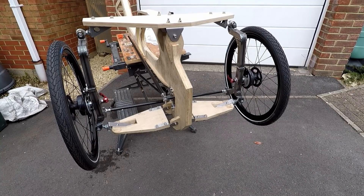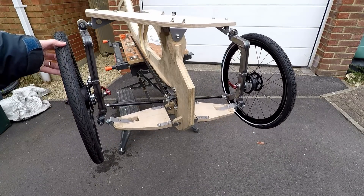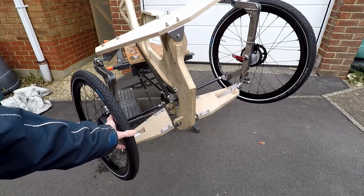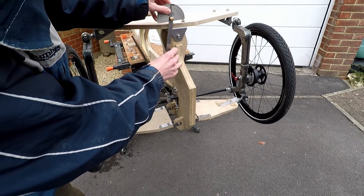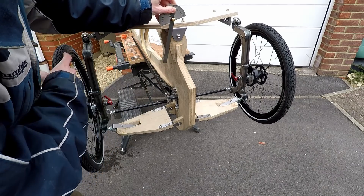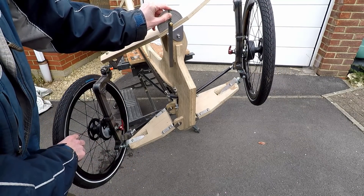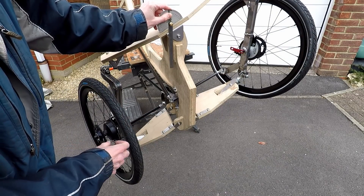Brakes work. Coming round to the front view, this is the tilting mechanism, all working quite neatly now. And you've got the steering — all pretty neat. I've been aiming for a tilting angle of about 30 degrees. So if I measure that with this little protractor, I'll put 30 degrees on there. So that more or less is the maximum tilting angle. And even at that angle we've got pretty good steering action — we're not reaching the limits of the steering angle.